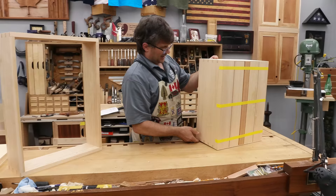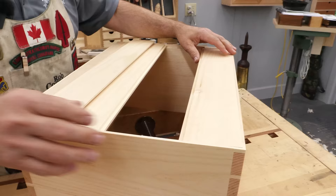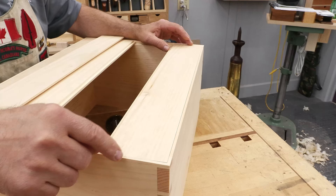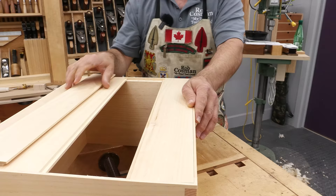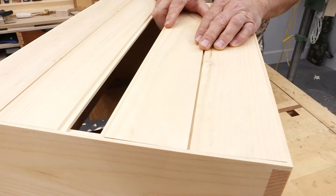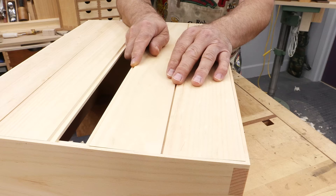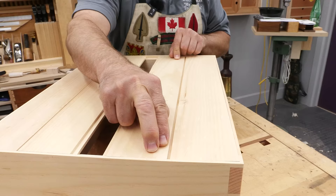There's what your pieces look like. You have a rabbet, or rebate depending on what country you're in, on opposite corners, opposite edges. So when I put this in place - starting with this one - this is going to be secured to this side; we can actually glue it in place. The preferential way is to nail it in place, so I'll glue it and probably put half a dozen finish nails along there, but only along this side, because as this piece expands it needs to be free to move this way. Because it's glued here, all the movement has to go in that direction.